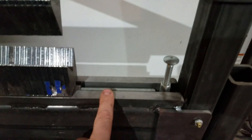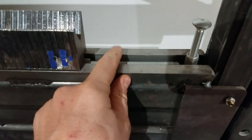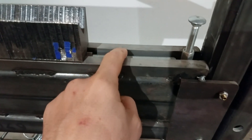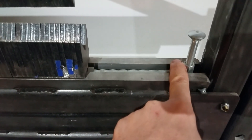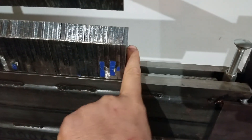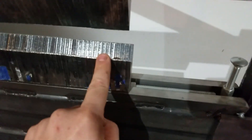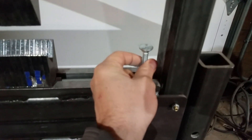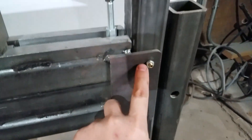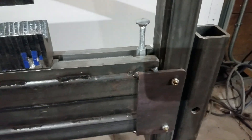This is the built-in narrow sheet metal die — basically just a three-quarter-inch wide groove, and you can actually bend sheet metal in it. It's a very narrow bottom die width so the force goes up. Then these are the normal wide bottom dies — the wider the die, the lower the force. These are two-inch wide and they're modular, I'll explain that in a minute. This is just a rough depth stop that's adjustable so you can get some bend repeatability. These are the slides — same thing with the set screws — this slides up and down and these keep the wiggle out of it.